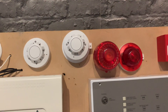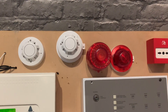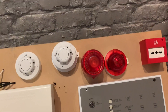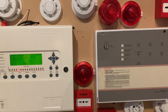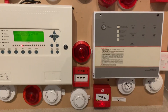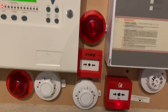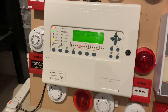You can see it's sort of struggling to tone hold a bit. I don't know why it does that — XP95 open area sounders or Sonos ones do that, which is quite odd. You can see we've got audible silence on the loop-powered beacons and they're not synced up perfectly because the panel can't sync too well, which is a bit annoying. Let's reset that and re-alarm.